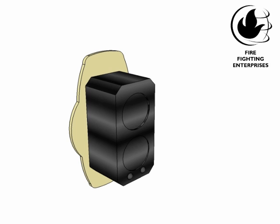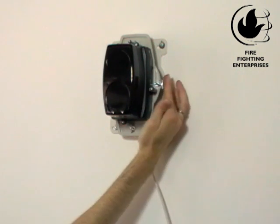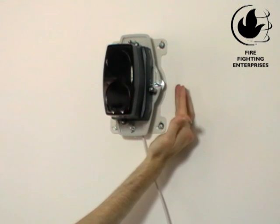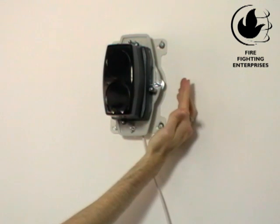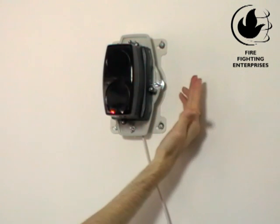The LEDs now mean something different. A red LED means that you are gaining signal, and an amber LED means that you are losing signal. Choose a thumb wheel — it doesn't matter which one you choose first, as we are going to adjust both of them. Turn half a turn. If you get the amber LED, stop — you are going the wrong direction. Turn back a half turn and you get the red LED. Wait, and let the red LED go out.